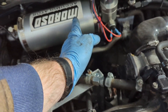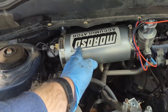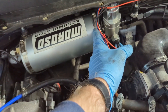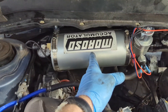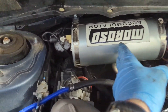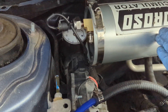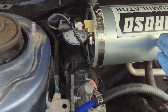As oil starts to flow in, that air gets compressed as an internal piston slides over. So if right now it's reading 20 psi when totally full, and this takes in half of its capacity in oil — around a quarter or so — then this should read double that pressure, maybe 40 psi for the sake of a simple example, although we'd be looking at the absolute pressure.